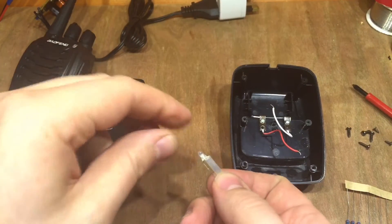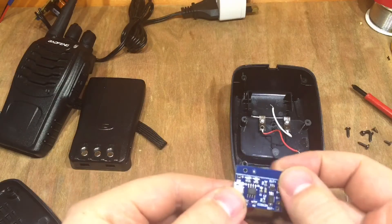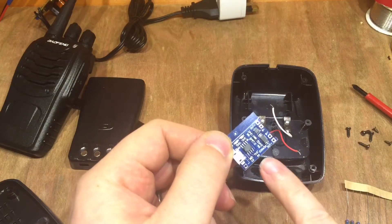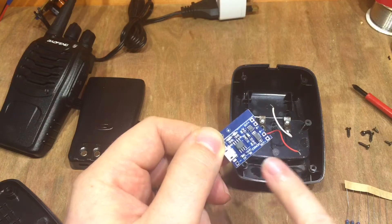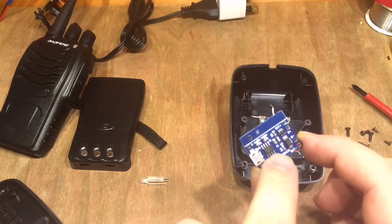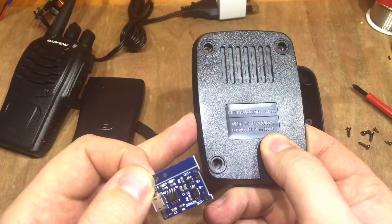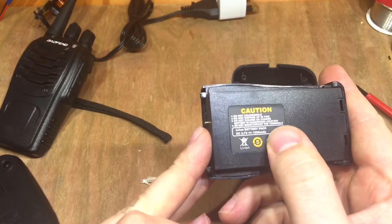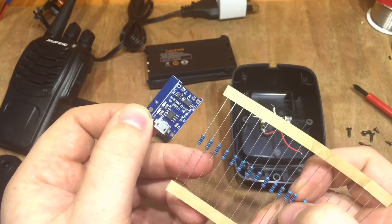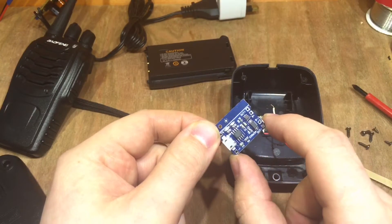Sadly I won't be able to use this LED — it's common cathode and I need common anode for what I'm doing here, or two LEDs entirely. But I'm not too worried about the LEDs. I do need to think about resistor R3, which is the one that sets the current we're going to charge the battery at. By default this has a 1k resistor, which gives 1 amp of charge. But the case quoted 500 milliamps and the battery is only 1.5 amp hours, so I need to change that. I have some 2k resistors and I can bodge one on there to charge at 500 milliamps rather than a full amp.